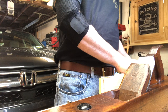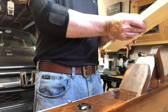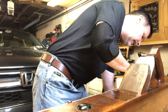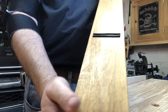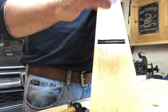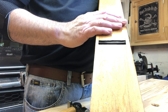Going back to the plane - there comes a point when planes have been worn out, and unlike a metal plane, a wood plane will wear out a lot faster. They often have the same issue that metal planes do because of the wear. The way planes are made, from the pressure of the cap iron, the wedge, and the plane iron itself being wedged in and hammered down, you get that little bump right behind the mouth of the plane or the sole, and it gets exaggerated in wood planes more so than it does in metal planes.